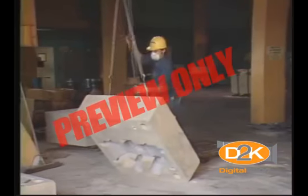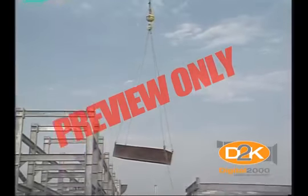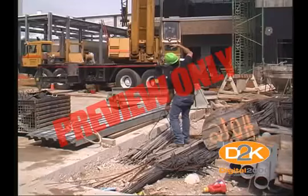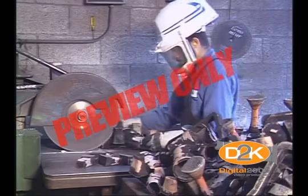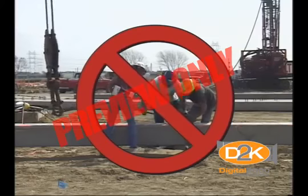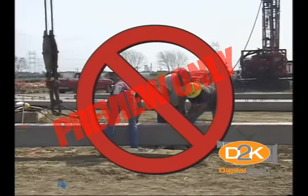You can even overload your equipment without a capacity load. The most common safety hazard is the operator trying to lift or stop a load too quickly — this is called jerking a load. Raise and lower loads slowly; avoid quick stops. Keep your chains, hooks, and slings off the floor. Hang them on racks, posts, or hooks on the wall. Never leave chains or slings on the floor where they can be abused. Metal chips on floors can cut slings.